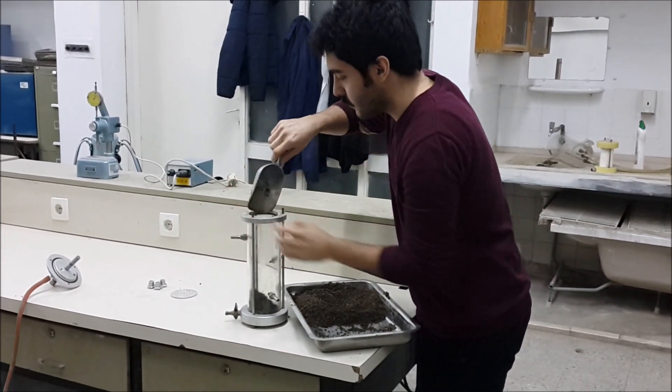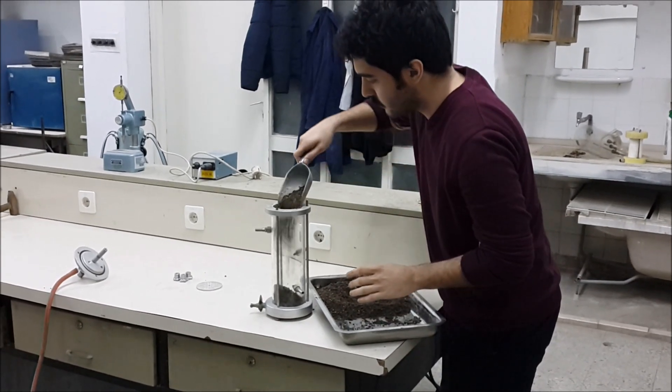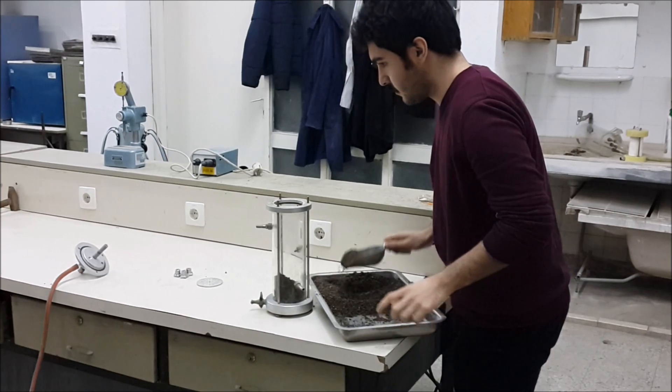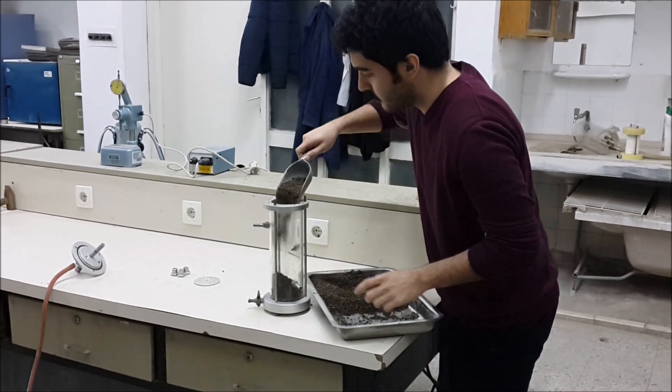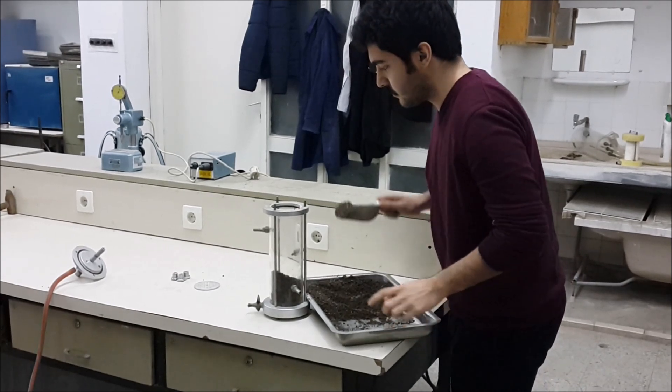Firstly, sample water using a plastic tube from the water inlet to the burette. The water will flow from the burette to the specimen and then to the funnel. Check to see that there is no leak, and remove all air bubbles.